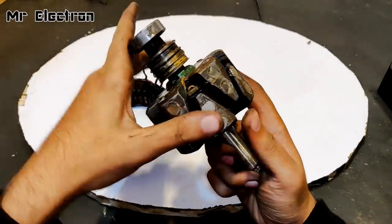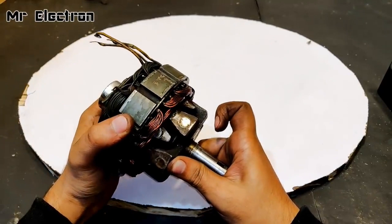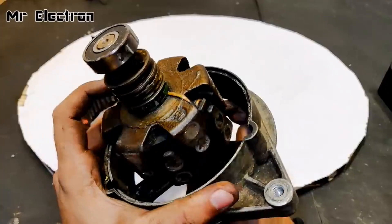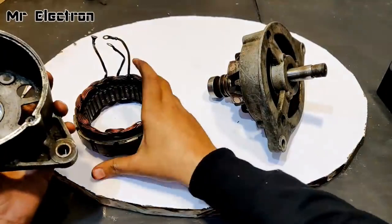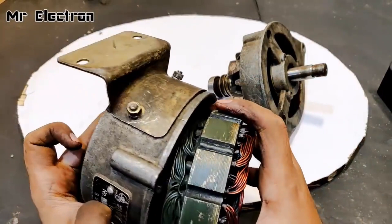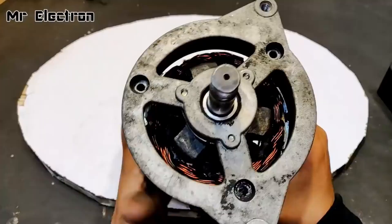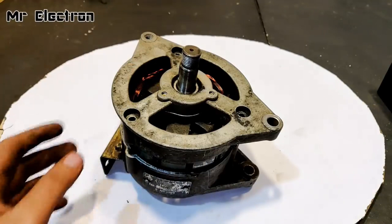This process is complete. Let's place the rotor inside and check if there is no projection and it goes in smoothly — yes, it's going really smooth, it fits. First, place the head on the shaft — the shaft and rotor have caught in the head and it's working pretty smooth. Now comes the base with the armature winding; I'll choose this slot for the wires. It fits perfectly. I'll hammer it so it fixes really nice, then place back the final long screws.